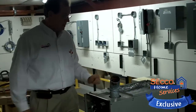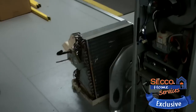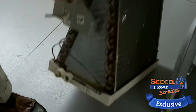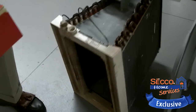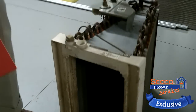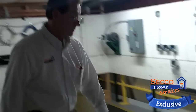A lot of times the ductwork hides different problems that we find. This is a typical air conditioning coil here that is out of a system, so you can actually see how the coil is being treated. It is a plastic pan that the coil sits in. All the dirt accumulates on the inside of this coil, so getting up into that inside of the coil is extremely difficult and important for a technician to do to make sure that the airflow is proper in a home and that the cooling coil actually does its job cooling.